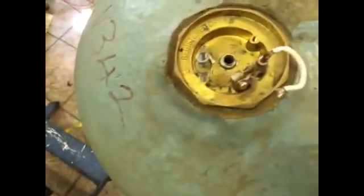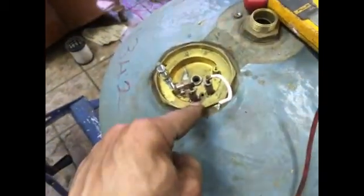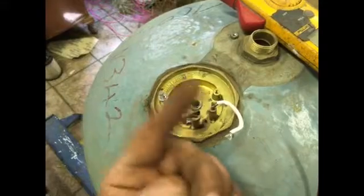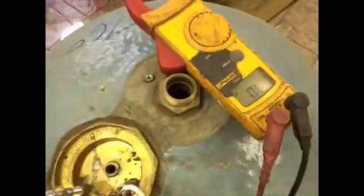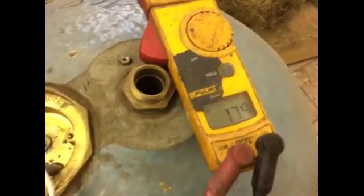So the stat's out and you're now left with the element terminals. Be careful at this stage - to get this out you usually have to heat it, and if the immersion isn't blown at the point you heat it, it's going to go pop. Quite often it blows chunks out - it fragments - I've had it out in the face. The heating element is a coil of copper wire going down through a little tube filled with some sort of white silica material, and coming back. There's a direct resistance connection between the two terminals. We're going to switch to resistance on the meter, test your meter for continuity.